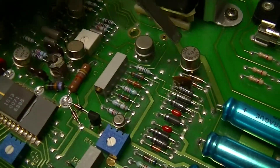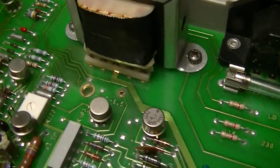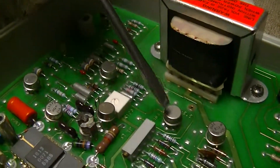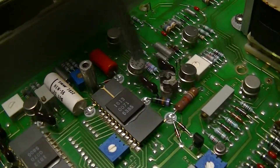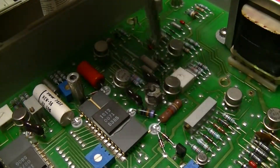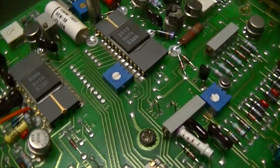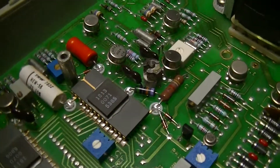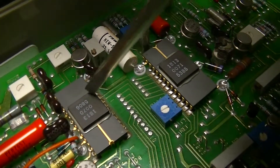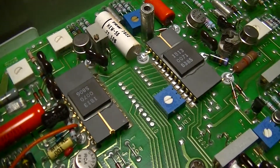There's some more devices — another custom device made by RCA for Hewlett Packard that is probably a transistor or possibly a potential regulator. There's another bunch of multi-pin TO-18 devices, another CA307C. A lot of these are custom parts, but those are going to be either instrumentation amplifiers or potential regulators. There are a number of trim pots for adjustment and calibration, a trimming capacitor, and these two devices with deep cavity lids are probably the analog-to-digital converters and various analog signal processing.